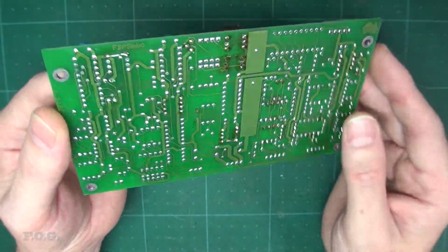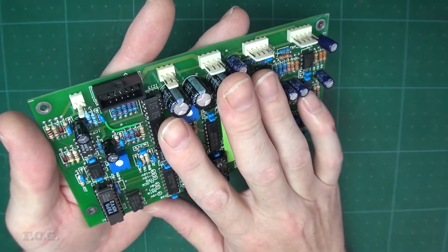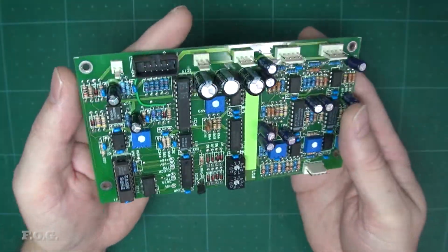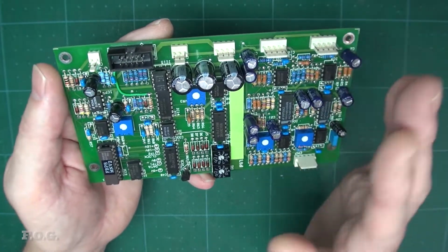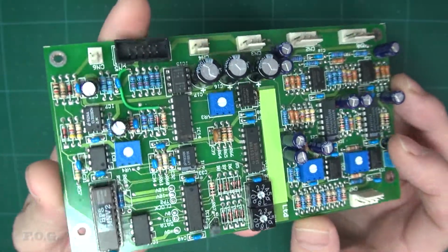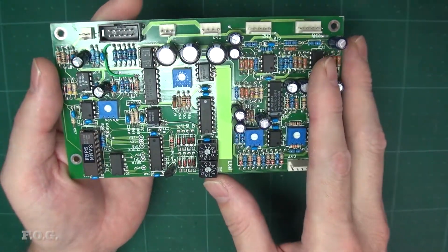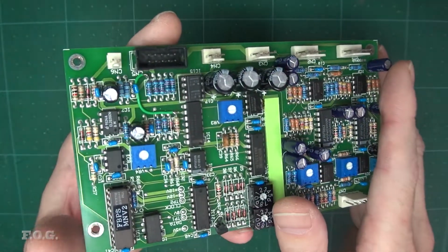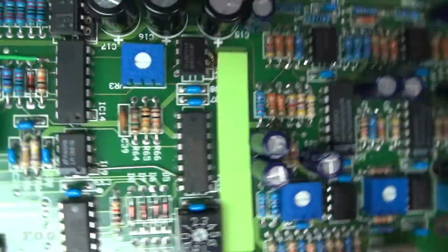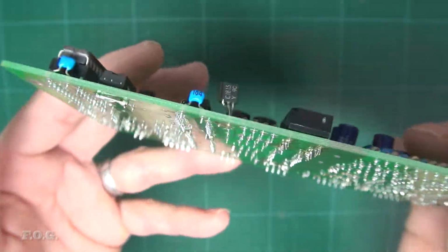But it's a little bit more complicated than that, because the reality is that you need to iterate. When you manufacture a PCB, you're going to get it wrong. And every time you iterate, there's a cost and there's a time delay. So typically what will happen is you will just not iterate after your first board. As with this board, for example, I'm pretty sure we didn't iterate. And there were manufacturing errors, because we'd pretty much given the circuit and basic layout to this manufacturer, and they pretty much did the rest. But even so, they'd managed to miss a few traces. For example, this trace was missing, this trace is missing, and there's like 5 or 6 traces missing. It's just silly mistakes.